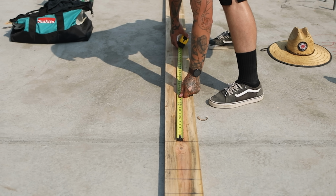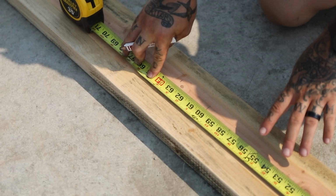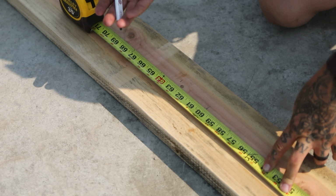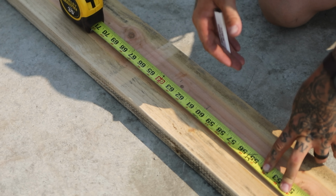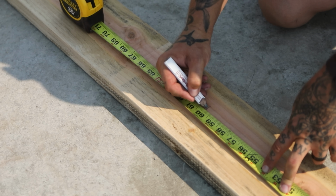So we're gonna butt the bottom of that header there. We have 5 feet. So now here's where things can get a little confusing. Butting the header down to this, I'm 5 feet. My window is a 3050. So the width of my window is 3 feet. The height of my window is 5 feet. So from the header down, 5 feet.